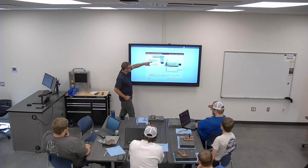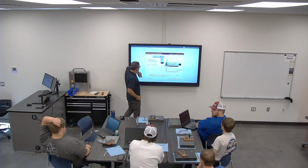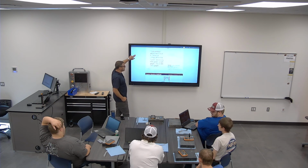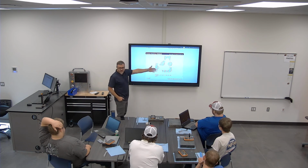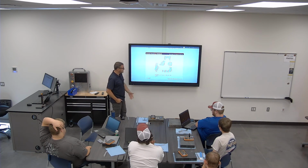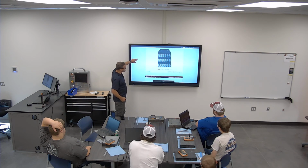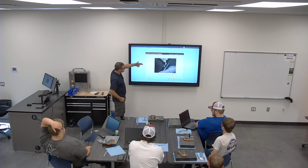Here's one that measures in degrees, minutes, and seconds. You have all kinds of wonky different things out there. What's happened is everybody's had a specific need for something. Same thing with a radius gauge. A radius gauge measures internal radiuses and external radiuses, and you have a radius gauge set in your toolboxes. We'll talk more about radius gauges. Angled sets, some of our students will make those. Oh, wow. Thread gauges. Thread pitch gauges.